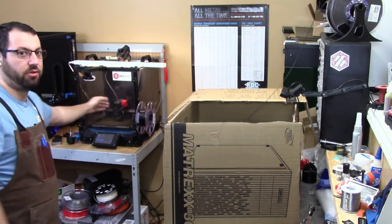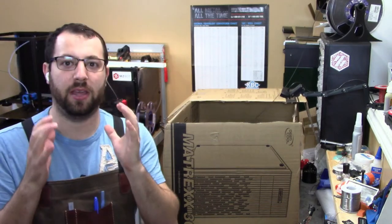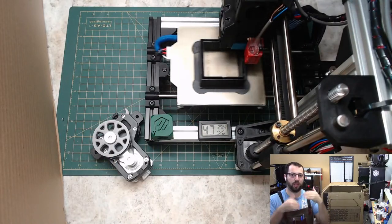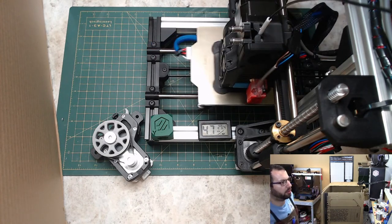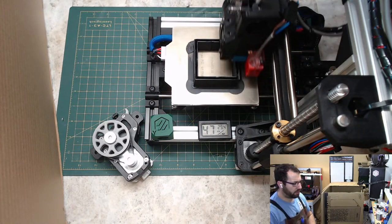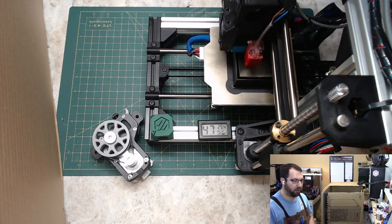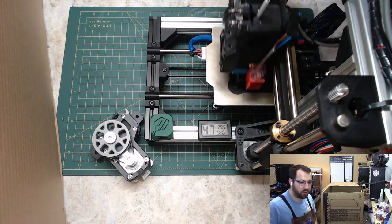That's one of the reasons the V2s are great, or any Voron is great for ABS, is because the frame is as compact as possible for the build size. And then we strap panels to the outside. There's no enclosure because the printer is the enclosure. You're getting the most out of it as possible. So yeah, the Lack style of enclosure, I find too big. I know the standard one isn't too bad, but when you go to enclose a printer, especially if you're trying to bootstrap for ABS, go as small as you can.